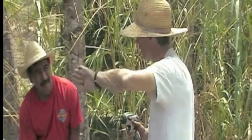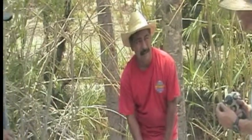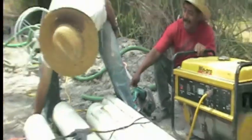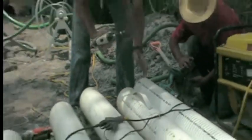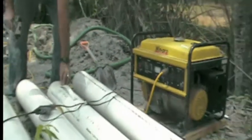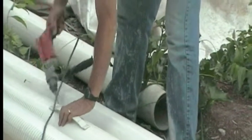There was lots of discussion on the different roles that each person plays and dividing up the work. Here I am placing centralizers on the casing — it's actually 8 lengths of pipe with grooves, and seven of them are for the actual screen. These centralizers help keep the screen in the middle of the borehole so that gravel can flow all the way around it.